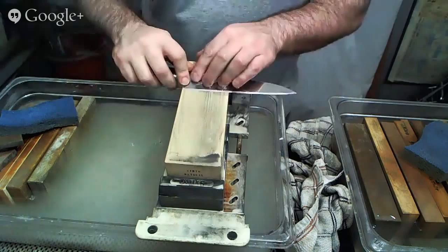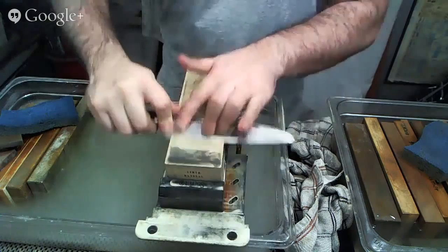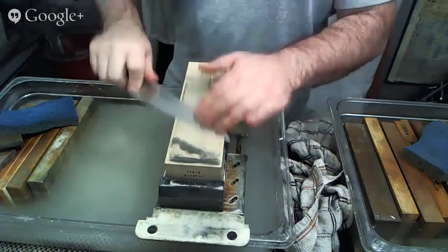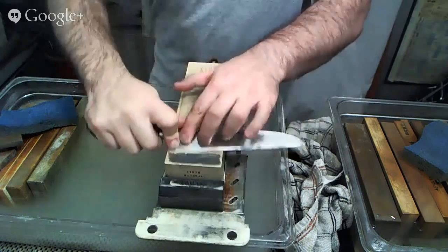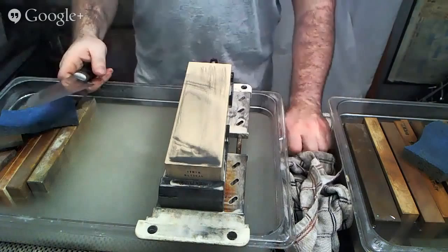And so what I'm looking for from this stone is the right amount of refinement for kitchen knives without being too fine, but still retaining a little bit of bite with it, where we'll get hopefully a longer lasting edge and a kind of more natural stone feel to the edge and the way that it lasts. The look, sadly, recreating natural stone looks with synthetic stones is very difficult when it comes to the kind of white, hazy mistiness.